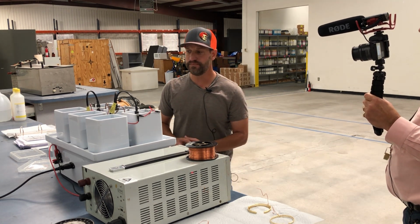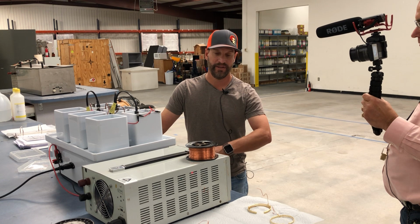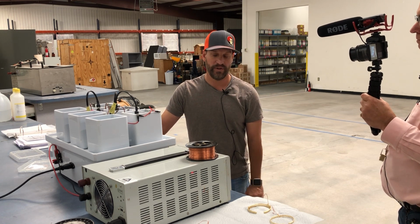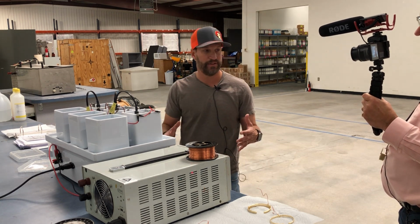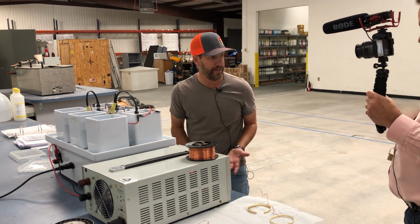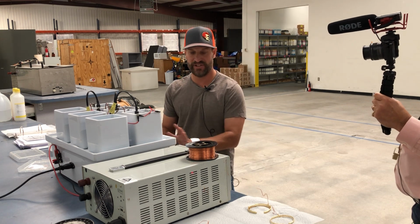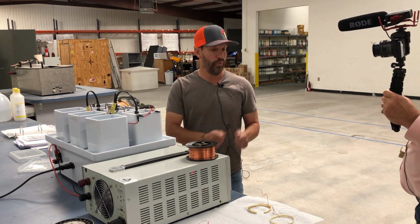And along those lines, it's really important wherever you set this machine up and this process up that you're not anywhere near a buffing machine where there's going to be anything in the air that could contaminate the solution. That's one of the worst things. A lot of times, for example in New York, people have small factories, they have their buffing machine right here, right behind it is their plating unit, and it's always contaminated. I know space is tight, but anything you can do to separate that a little bit, even just a plexiglass that goes all the way to the counter that you can set over it when you're buffing, will help.